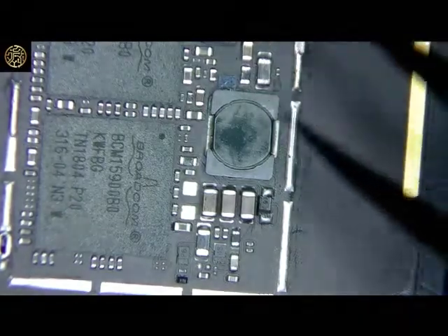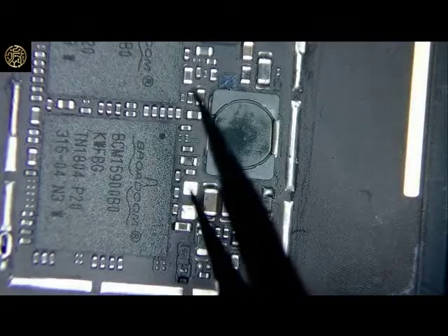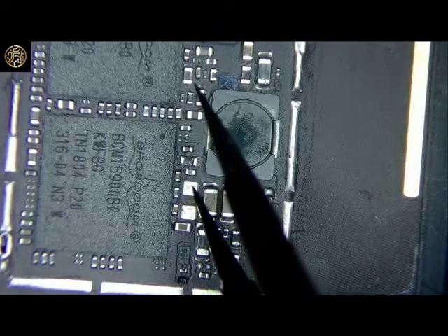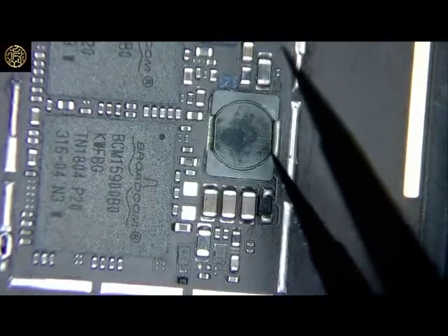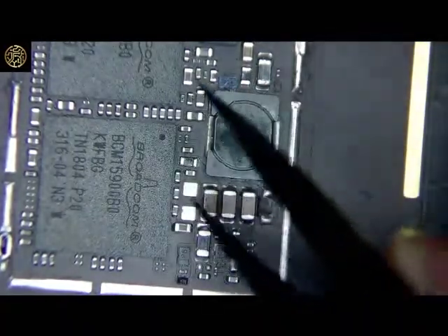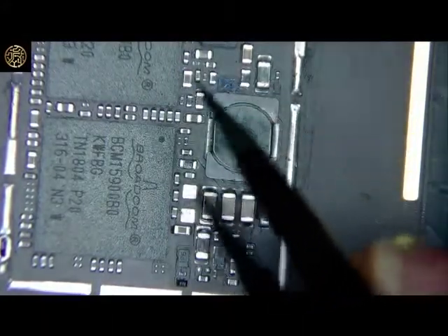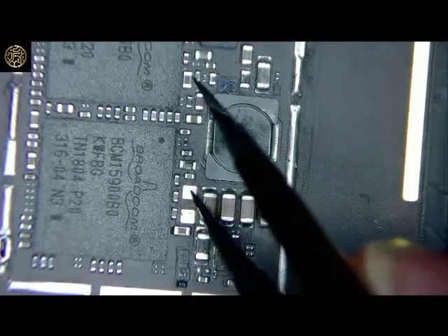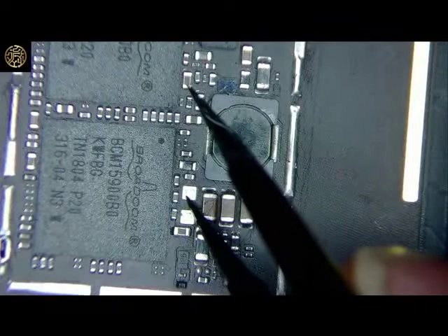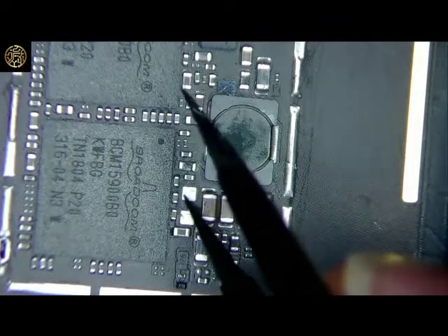This only happens during the boot cycle, about halfway through. So I took the board back out and started checking this line here — had a reading of about 150 on the diode test, in diode mode. All these components are on the same line, around 150. Once I removed this capacitor, it jumped up to about 290 to 300, somewhere in that neighborhood.